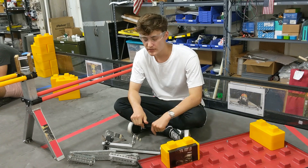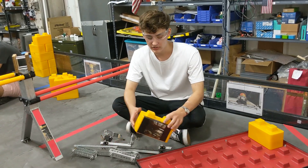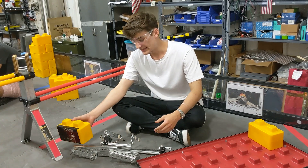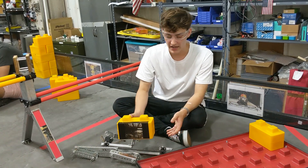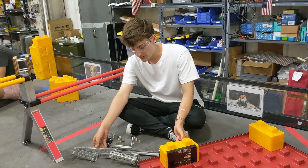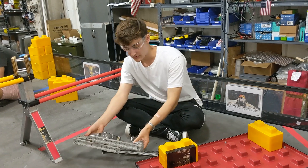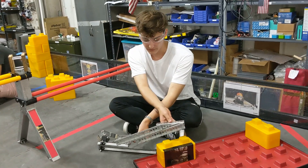Some considerations we had in mind when designing this: number one, the stone had to retain its orientation. It can't flip over, otherwise it won't stack, so it needs to retain the upright position. The parallel bar design — the four-bar design — was our initial thought because it does this, taking it from the front to the back.